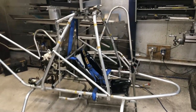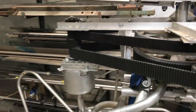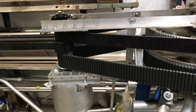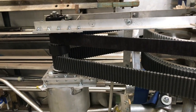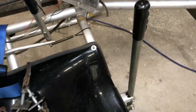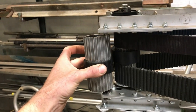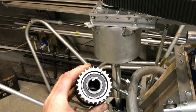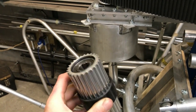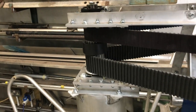A little update: I've changed the ratio on the belt system, so this pulley now is only 20 teeth whereas before it was 25, quite a bit difference in diameter. These had sprag bearings inside so you've got an overrun, whereas I couldn't fit those bearings inside that one, so for now there's no overrun.